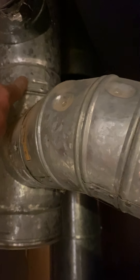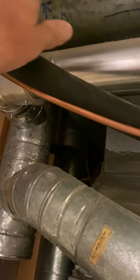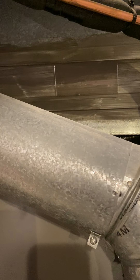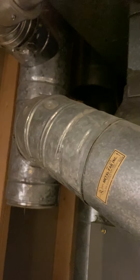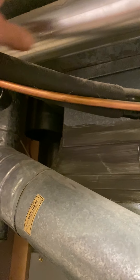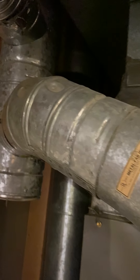Combustion air is okay, just shorten as needed. On the flue, we're going to remove the bottom tee, reuse the cap, and put it here. The new starting collar will come up here. Run the water heater flue in four inch aluminum — you'll need to come forward enough to get past this.